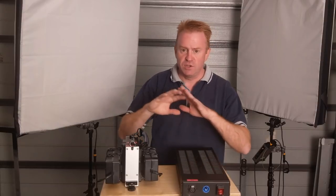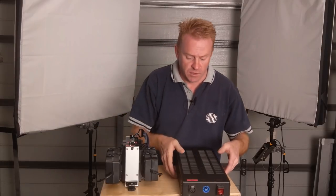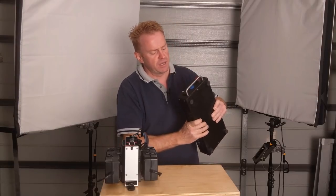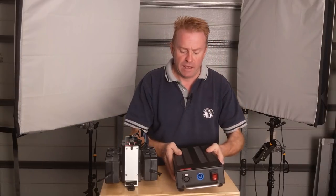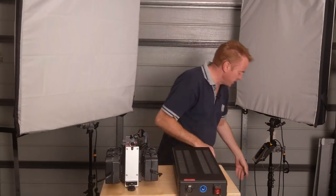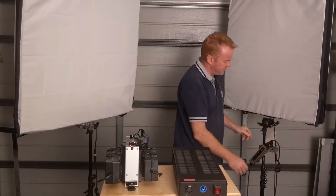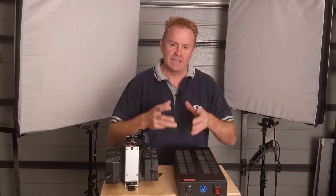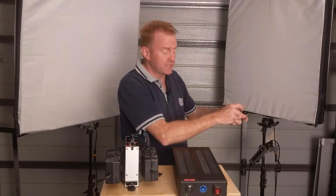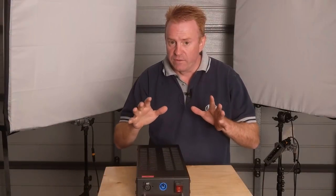However, I don't actually use this solution — eleven connection points is too many, and something inevitably disconnects. I'm using a PSU with a Neutrik connector that won't disconnect, and I run a three-pin lead out. I plug the PSU into the wall outlet and run a long three-pin lead to my light, so there's only one cable on the ground going to the power supply at the wall. I have the controllers mounted to the light stands with super clamps, already connected in the case I transport them in. I literally take it out, mount it on the stand, plug the power cable into the PSU, plug into the wall, and I'm off and running.